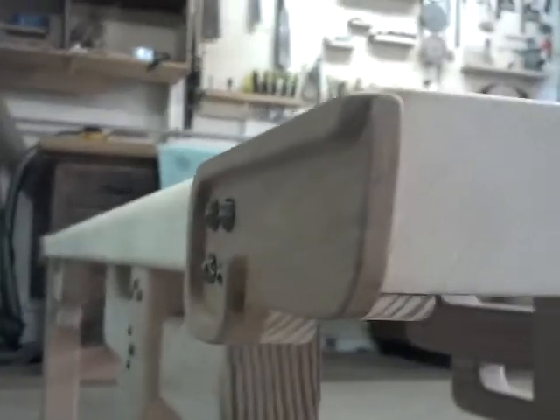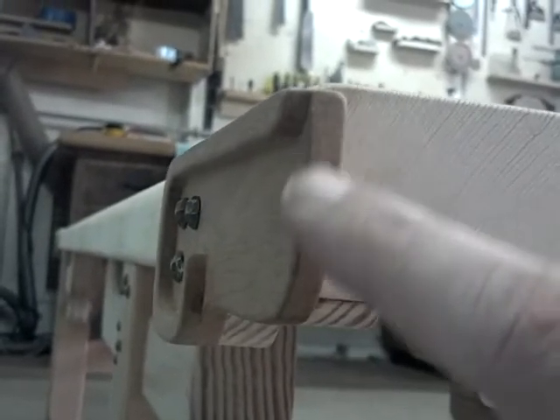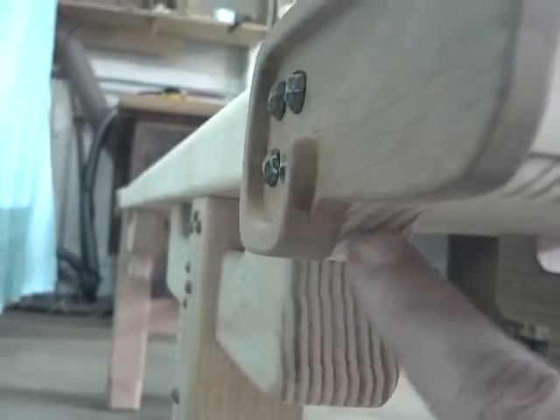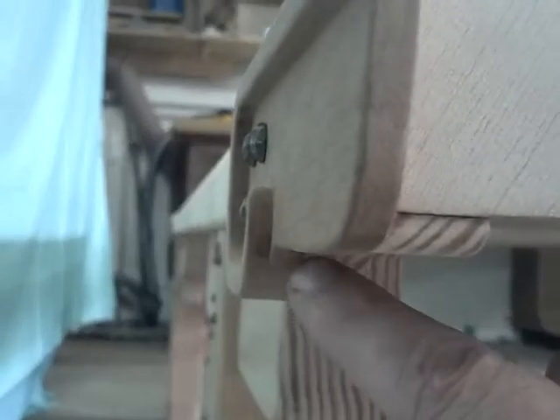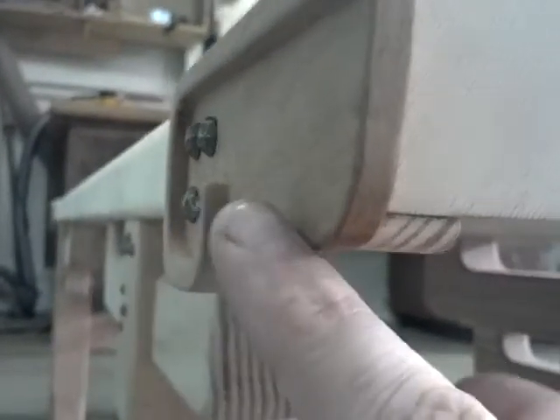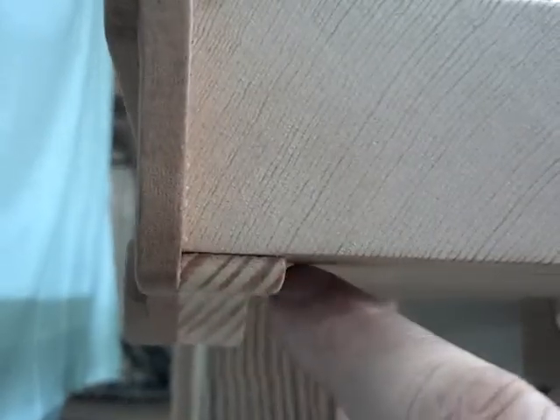The grain on this Douglas fir was really beautiful. Since I'm kind of under the bench — and some of you woodworkers might understand this — when I mortised this piece of mahogany, I carved it separately. When I mortised it into the side of the bench, I realized I was going to have this overhang down here. I didn't want it to snap off later by somebody kicking it. It's about three-eighths thick here, maybe five-eighths thick there. So I decided to cut from behind where you can't see it and place in a glue block to strengthen this. In the future, I'm simply going to increase the thickness of the mahogany so I can do away with the added glue block — it'll be thicker down here.